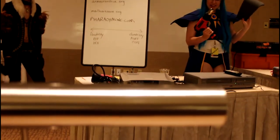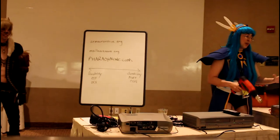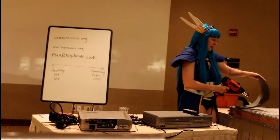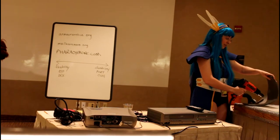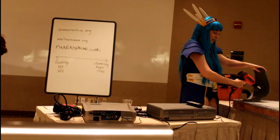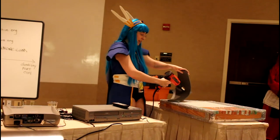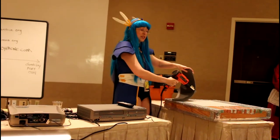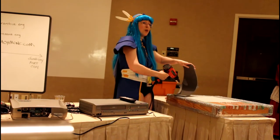So hopefully, Murphy aside, this is going to work. So here we go. I'm going to bend it in the center, get pretty close to it. I'm going to try and do this at an angle where you guys can see it. You see I'm constantly moving the heat gun. Right now this is set at about 400 degrees. That's pretty hot, it'll boil water.